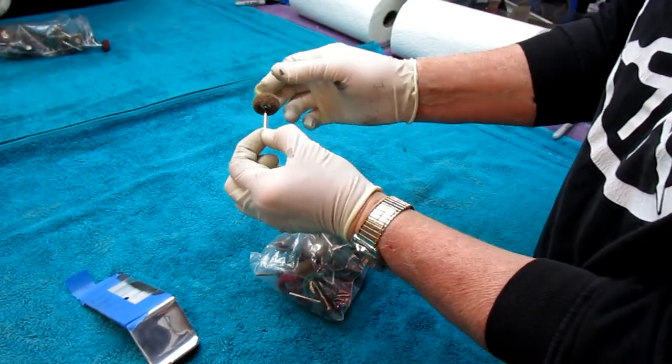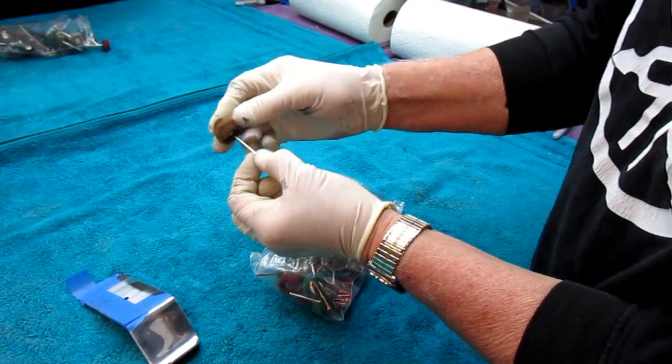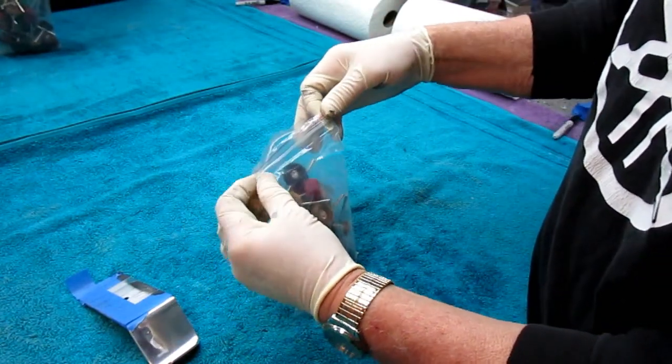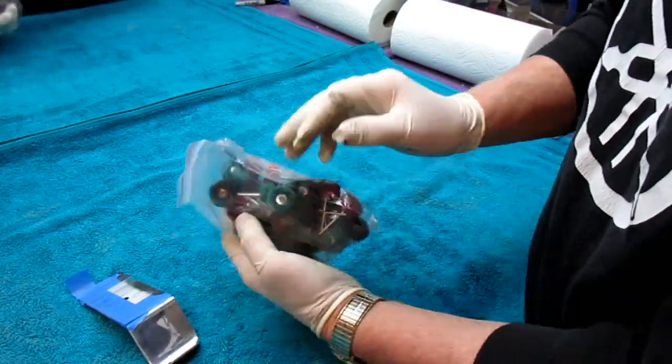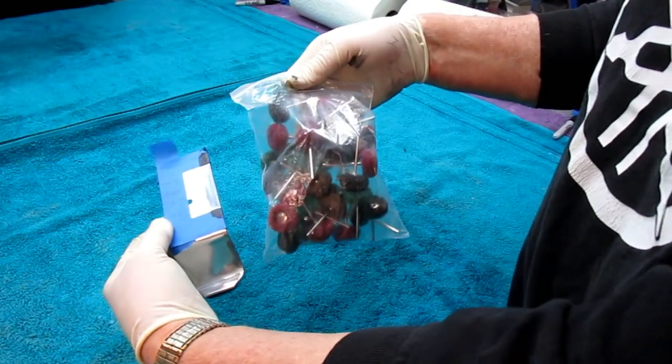So if you put this right at the end and you induce this and then turn the Dremel speed up to 10, this is going to fly off and take a tooth out. So the way you avoid that, use a lower speed, and of course wear safety equipment. So I'd say the first thing I learned from this test is this was a good investment.